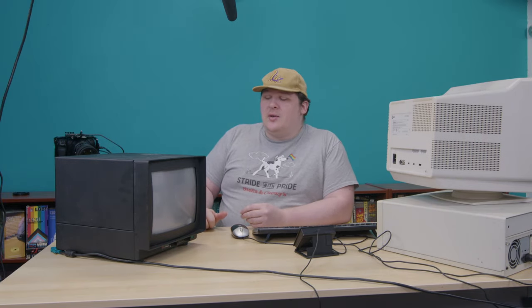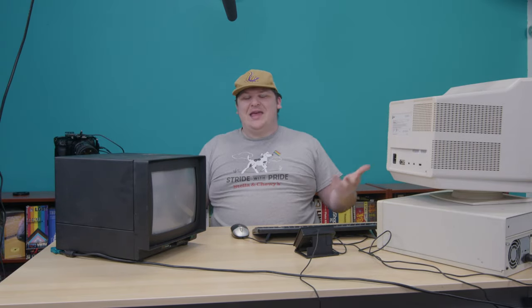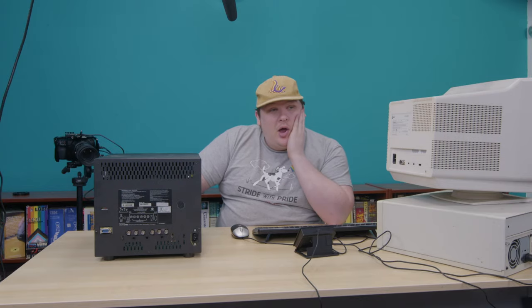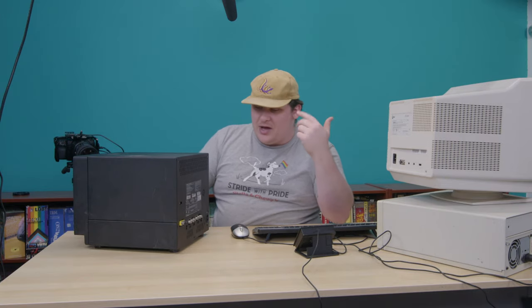In addition, we learned, and I don't know that this is unique to this product, but based on the manual it seems like it is, that this supports differential analog input, which I've never heard of. You can feed this thing balanced analog video, push-pull, so that it's completely noise-resistant. Who does that? That's a thing? And I actually think that possibly that's what the two sets of BNCs might be for. I didn't finish reading that part of the manual closely enough. But yeah, differential signaling, so you, I guess, wouldn't get crosstalk. So I'm wondering if that's what this is for. You put your push there and your pull there. Maybe? I'm not sure.